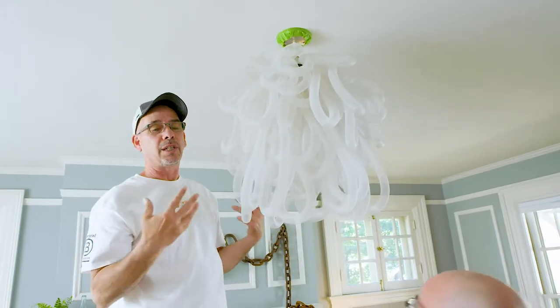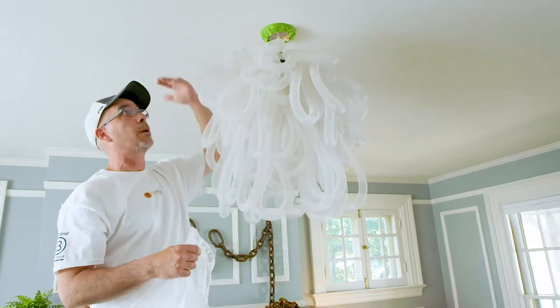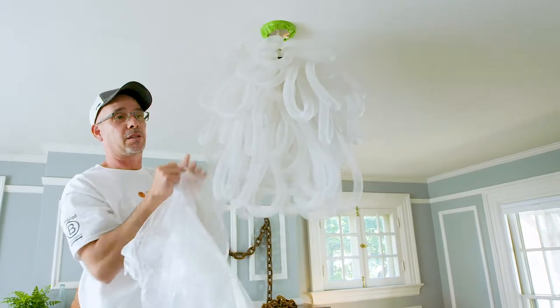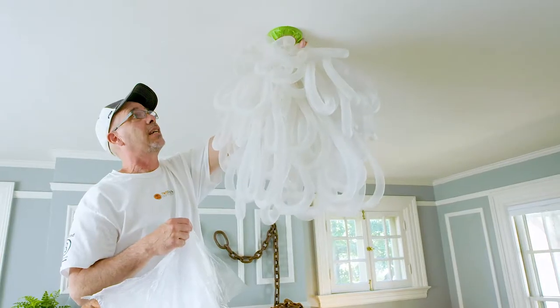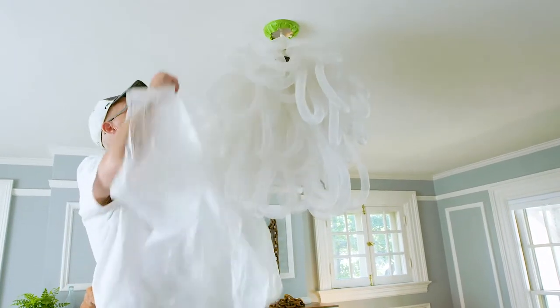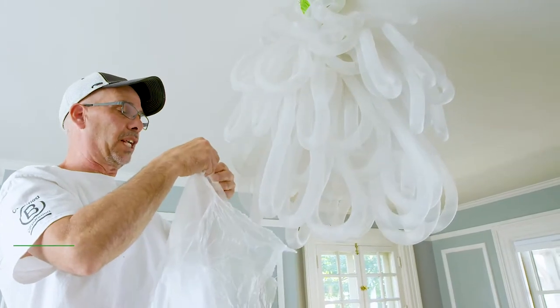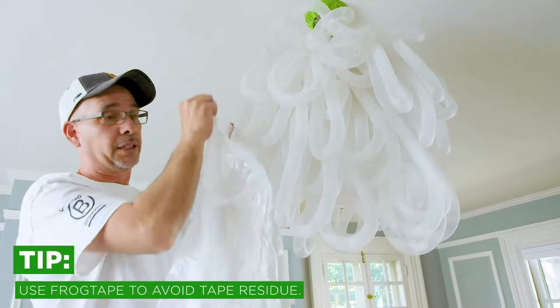Sometimes you get into really unique lights. It'll look kind of goofy, but you have to get them covered because we want to paint the ceiling and we don't want to get splatters all over this. I don't know how much this thing costs — it could be valuable. So I put the frog tape around the flange because that'll protect it and release quickly when needed. Now I'll use masking tape to tape over that. I'm using masking tape because it's the cheapest tape, but I don't want to put it on the fixture because it won't release from the fixture properly like the frog tape will.